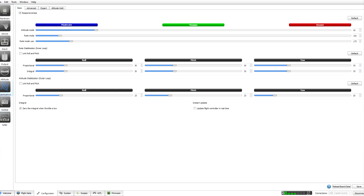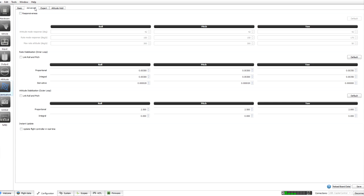So we click on stabilization on the left here, go up to advanced. Now we're going to start changing all these values on here to suit this particular quad. I'll go through these quickly, but I will put a link in the description to a picture so you can actually take your time, look at them and input these values yourself.